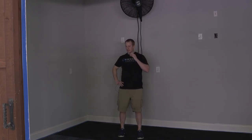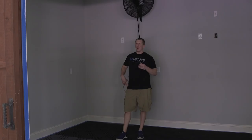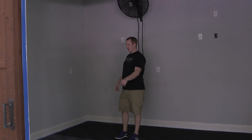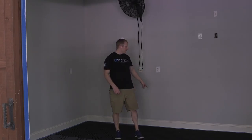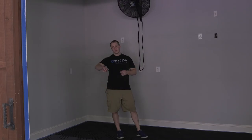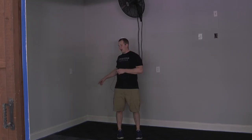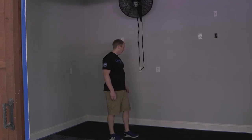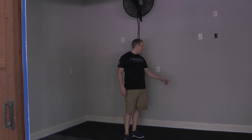So what I did, and I did this myself, I put the trim in around the door frame. I'll show you in a second here, I trimmed out the entire baseboards. And then filled them with a wood putty, filled all the nail holes, followed with a latex caulk around the top. And then I painted them with an off-white, it's called Duck White from Sherwin-Williams. It's a satin paint. Obviously I taped the floor.